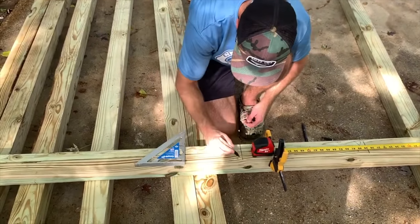So as a reminder, I have videos in the description that go over every step that we've completed so far with the modern shed, but this video is all about trim. To start, we're gonna install the side trim on the outside corners of the shed. This corner trim is gonna cover up the butt edges from our siding installation that we did in a previous video. So I highly recommend that you pre-paint your PVC trim boards.